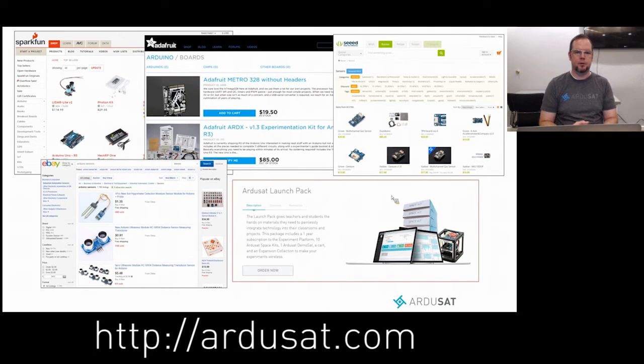There's lots of vendors straight from China that will send sensors that end up being very inexpensive, but very powerful. Like you can see, there's one on there that's 91 cents. That's an ultrasonic sensor. It tells how far something is away, so it's the basis of a lot of robots. It can see whether it's getting closer to a wall or to an object, and then you can tell the Arduino, when you get too close, make the motors go backwards and turn so that you can get out of the way of the object.